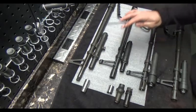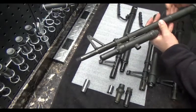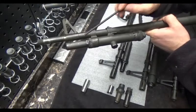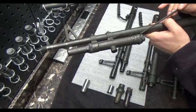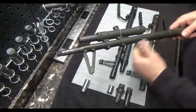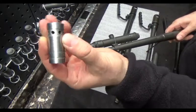So to start off here, this standard barrel consists of a bunch of different parts on the gas system. We have the gas extension that has a lock washer to hold on. We have the gas nut, which also has a lock washer to hold on. We have a gas plug in the bottom. And then on the inside, we have a gas piston.